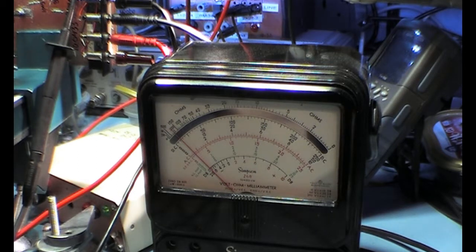So often in old tube amplifiers or other tube instruments, in the list of instruments you should use, they mention the voltmeters. If they talk about a vacuum tube voltmeter, then you can use a modern meter. If they talk about a normal analog meter, then you should use that analog meter or do the math, because you will never measure the values that are drawn in the schematic.